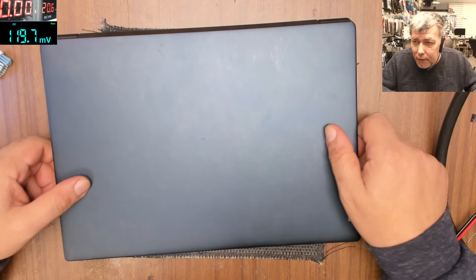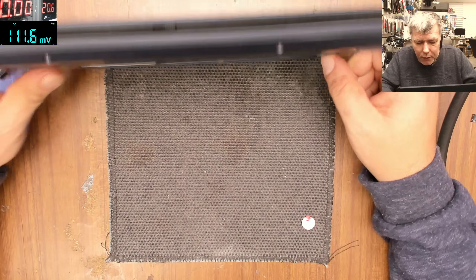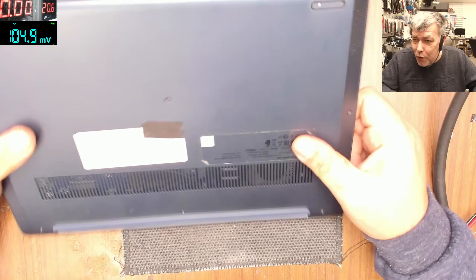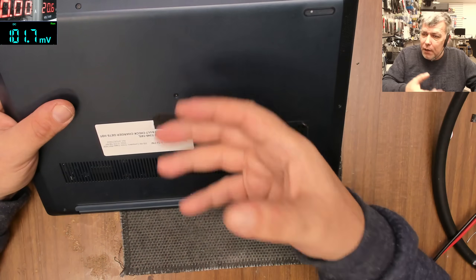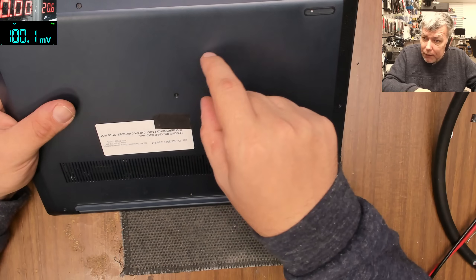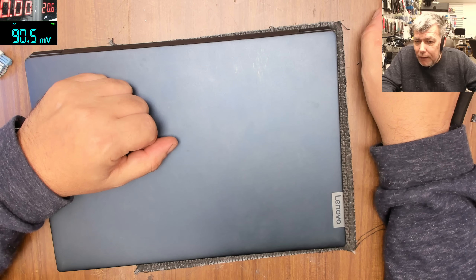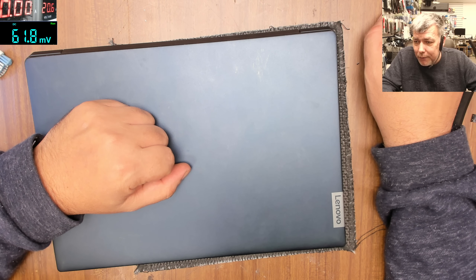So I will say — pay attention if you have this kind of laptop. Now you know how to fix it if you drop some water on it. If you didn't drop water, trust me I've found a lot of these laptops with frozen BIOS — you just open the back cover, unplug the BIOS battery, unplug the main battery, leave them like five minutes, then plug them back and it should work fine. Thank you for watching, like and subscribe if you like the video, and see you on the next one, bye.